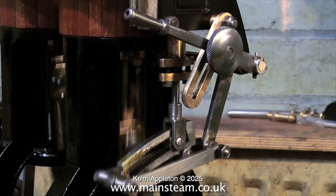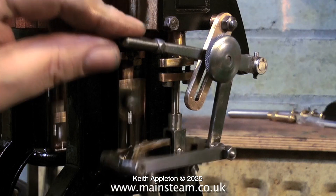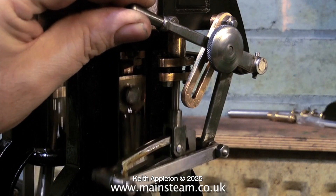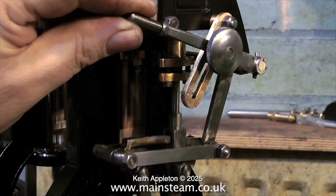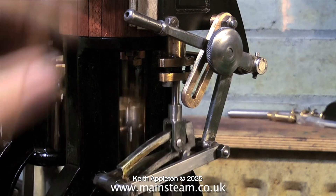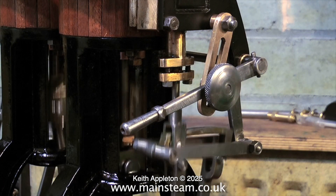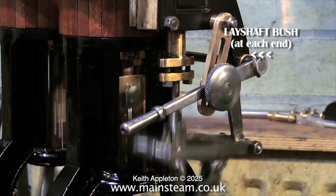What's interesting is that the bottom end of the engine is not yet really tightened up. The main bearings and the big ends are just a gentle fit. I always do it this way to avoid any picking up on the bearings should they be too tight. I'm now testing the reversing mechanism, which in the end I had to fit a bush to because it was far too sloppy. As you can see at the back there's now a phosphor bronze bush fitted onto the bracket.